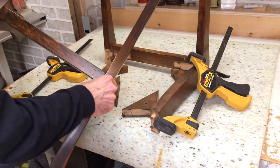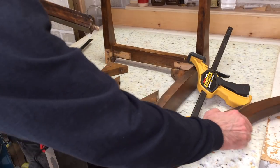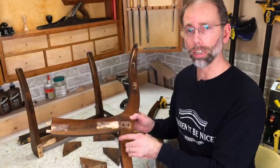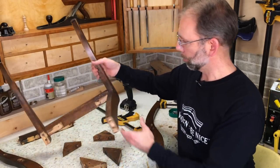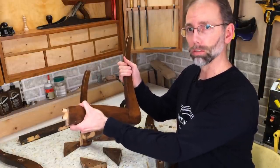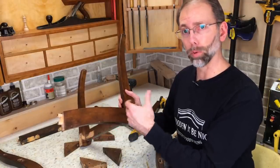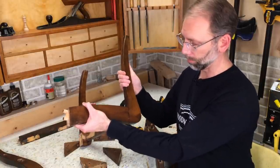These pieces can now come apart. This one is fractured here, and this one's broken too — another broken part. As I'm taking this apart, I'm starting to see signs that it's been repaired before. There's some modern glue on the inside, and this joint here is Loctite. There's another story with this joint — I see modern glue in a couple spots, but it's loose. This is an example of how not to repair a chair. You can't just squeeze a little bit of glue in a joint and hope for the best. You need to take it fully apart, clean off both parts, coat both parts with glue, put it together, and clamp it. This is an example of a failed repair.